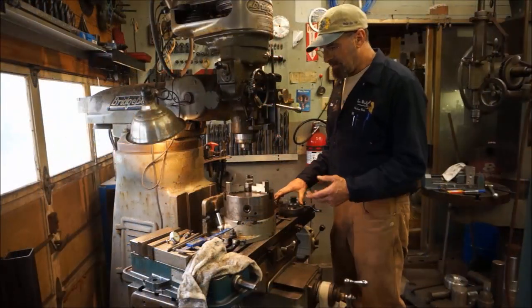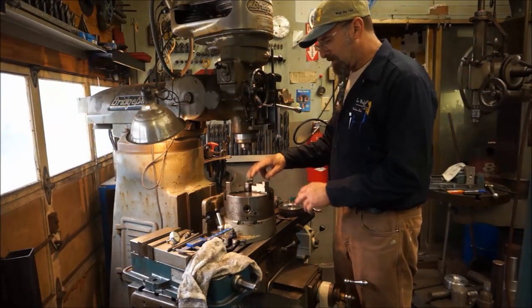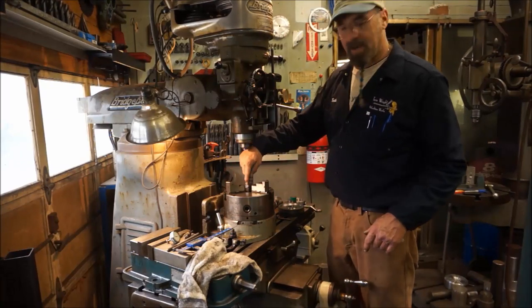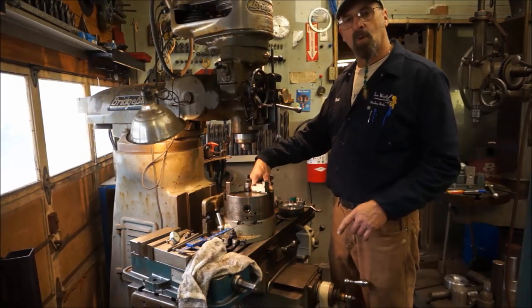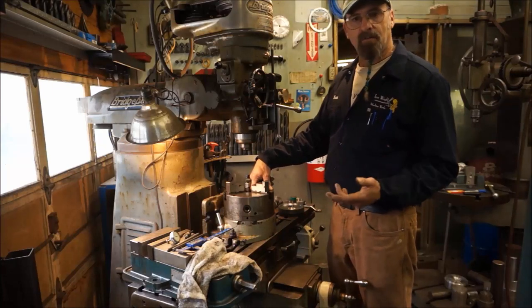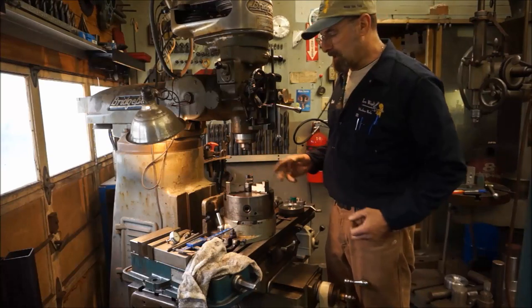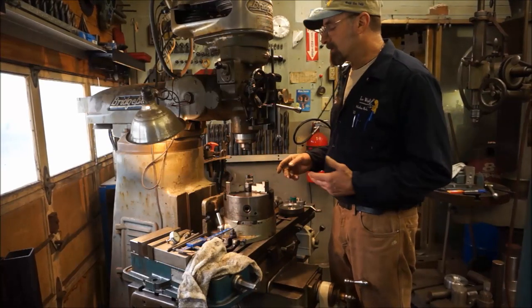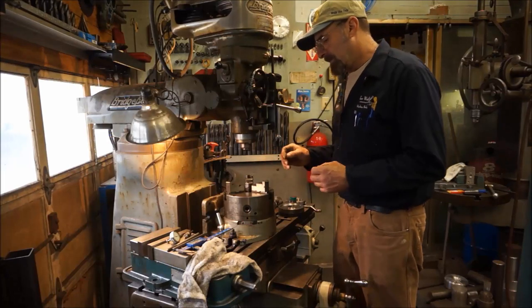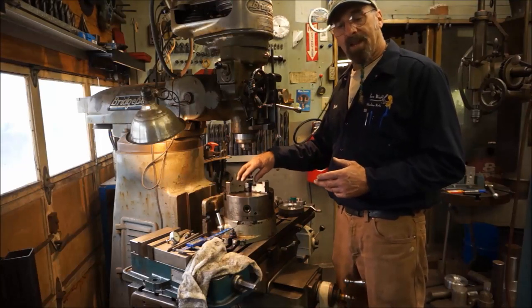All right, what I want to do first is gain center. I would like to know center of the index head. Sometimes I have the jaws open, I reach down in, and I can dial in this bore. This bore may be within a couple thousandths of the diameter or the axis that the jaws actually crimp down on. So you always want to make sure that you check that if you want to really fine tune. There's nothing better than actually dialing right on your part.